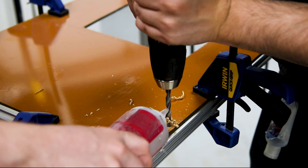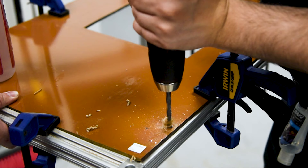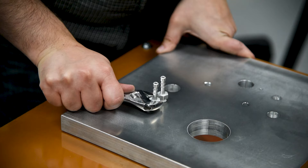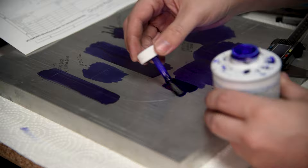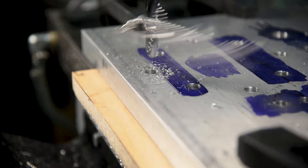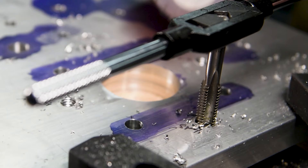Because Garolite is literally made of glass fiber, cutting it can be a little bit tricky — it's a really tough material, so you just have to go slow and take your time. Mounted to the top of the Garolite is the base plate of the vacuum system. Our design was based on Ben's from Applied Science, so we followed his lead and made the base plate out of a 12x12, one-inch thick aluminum slab. This gave us plenty of room to make any of the holes, threaded or otherwise, that we'd need to mount all the different pieces. To mount the diffusion pump, we needed four threaded blind holes for some half-inch threaded rod.